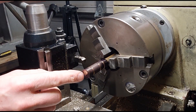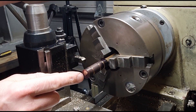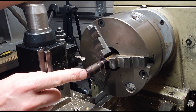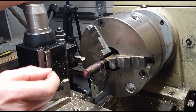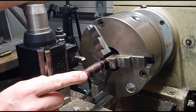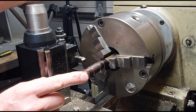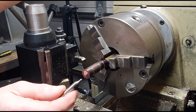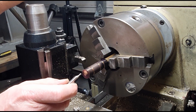We've got to have a through hole all the way through and on the plans it's an imperial size, but I'm going to make mine 3mm because I've got 3mm Allen bolts to hold those down to the cylinder heads. We'll start off with a center drill, get that marked to the center, and then drill it all the way through with a 3mm drill.